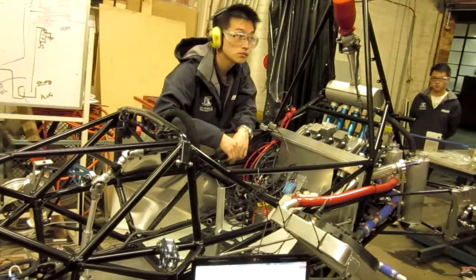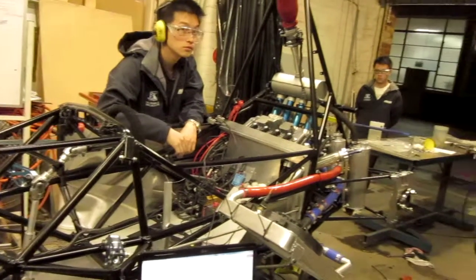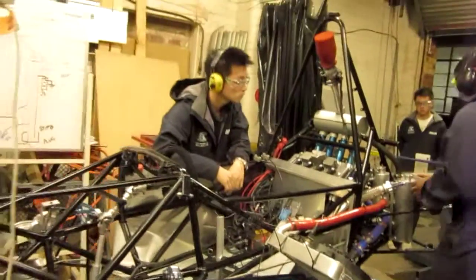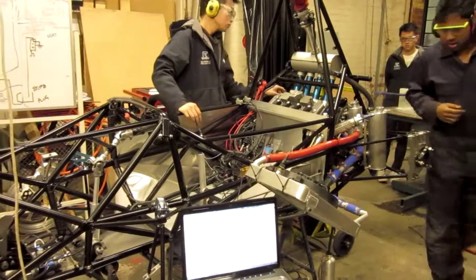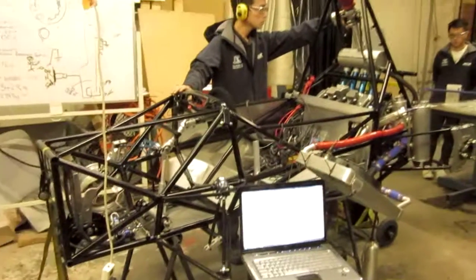The water pump, is it like off for the first 50 degrees? No, it should be on. It should be on 5 seconds, off 10 seconds. At 6 volts. Yeah, keep trying this as well to see if there's stuff going in there. Yeah. Let's go again.